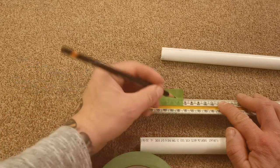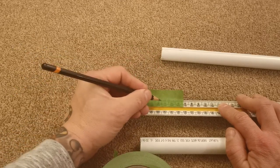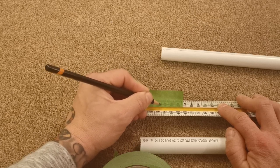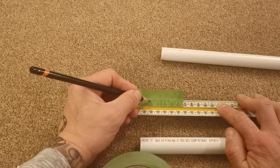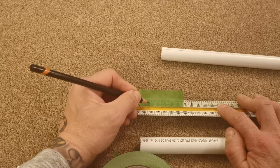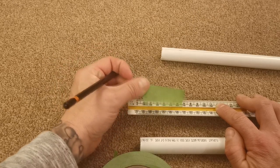I've got one mark on the zero or 360-degree position. To get the opposite side I need half of 68, which is 34, so I find the 34mm mark and mark that. Half of 34 is 17, so I find the 17mm mark, and also 34 plus 17 is 51. Those are my three marks giving me the 90, 180, and 270 degree axes.